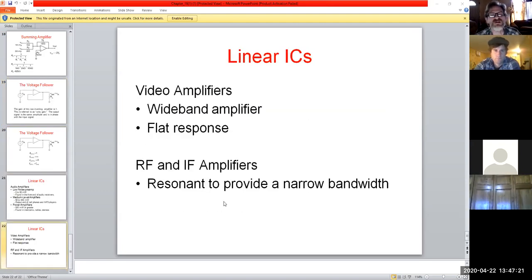That's pretty much my lecture for today. I've got the homework all posted up, and I'll be going through some more labs. These beginning ones with the op amps won't be really complicated. In the non-inverting one, I just ask you to change the feedback resistor value, step it up, and observe what happens, because that changes the gain factor. The same goes for the inverting one. I'm going to have a couple of beginning op amp circuits for you, so if you have any trouble with any of those, let me know and we can go through them, and hopefully it all comes out fairly well.